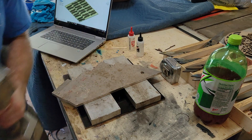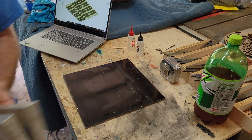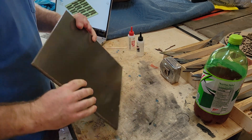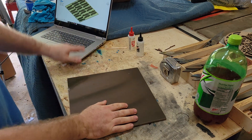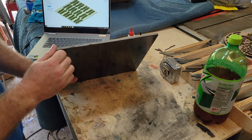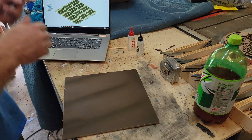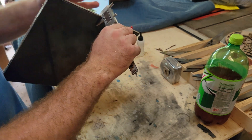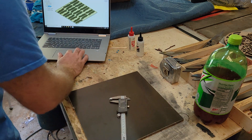We are back. Taking the weights off — I ended up putting an extra piece on there just to be safe. We've got two pieces that are epoxied together and they're not going anywhere. Now, one thing we need to do before putting this on the machine is measure the exact thickness in Fusion. I guessed about three-eighths inch, but we want the exact measurement. We measure it — it's 0.337 — so I'll go into Fusion and change that.